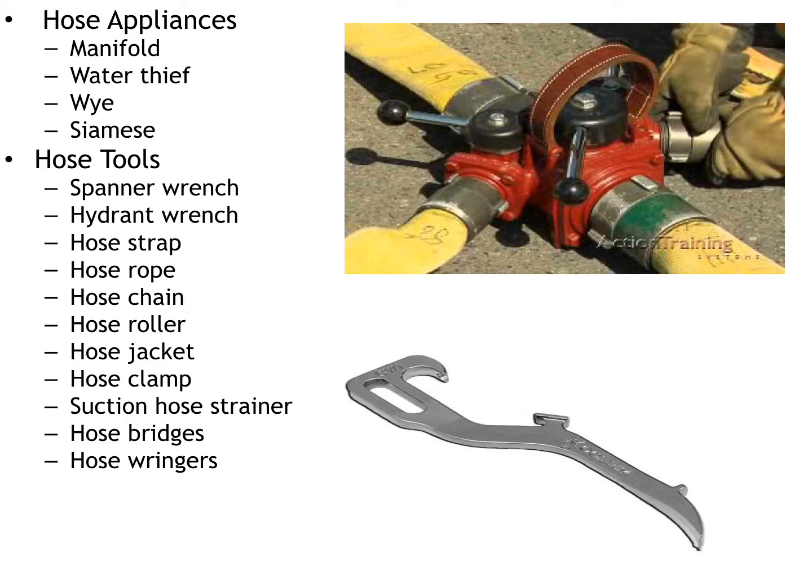A hose clamp is typically associated with use on large supply lines. Now, you may have a structure fire on a busy road, and you can take a supply line and lay the supply line across the road because the hydrant's across the street. Well, maybe you have emergency traffic or you need to move positioning of apparatus and you need to physically shut the line down really quick and get the water out of the hose so apparatus can drive across the hose. The hose clamp is physically going to clamp down on the hose, and you can still leave the hydrant on, and you don't have to disconnect the hose from the hydrant. And this will allow traffic to pass over the hose.